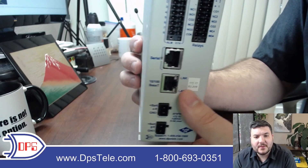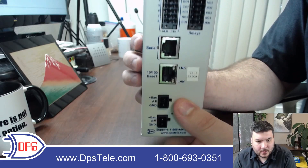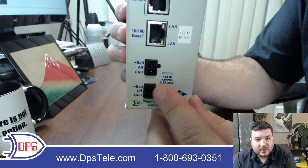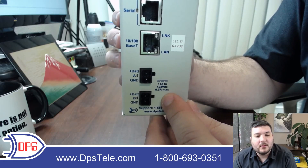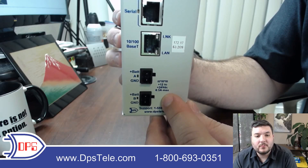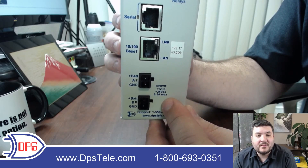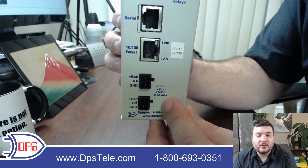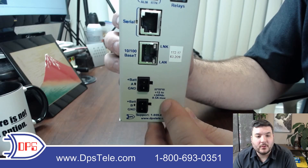Of course that means the NetGuardian itself is network enabled — here's your 10/100 port for your LAN. And then finally the power inputs. This is a plus 12 or plus 24 wide range voltage model. You'll find some RTUs that can do negative 48, some that do plus 12, plus 24 — a variety of different standards. And if you need to run AC, you can use a wall transformer and just convert the AC to whatever DC voltage input requirement the device needs.